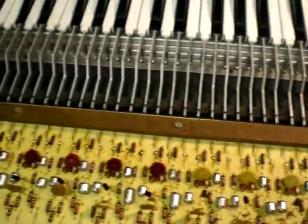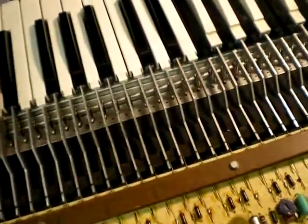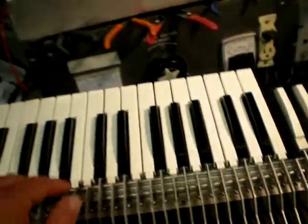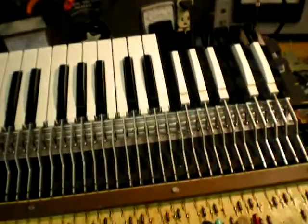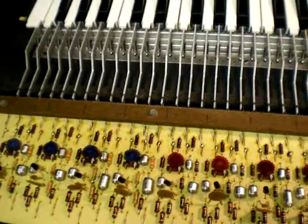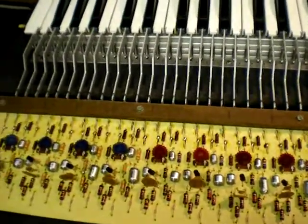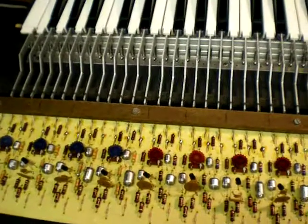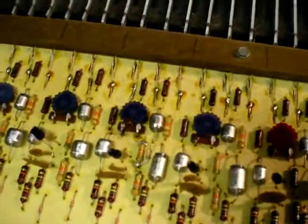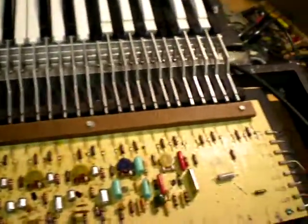They've got some wire around on that — I don't know what they did there. Anyway, monophonic, on groups of three notes all the way up. One of these pots was just disconnected, that's why it wasn't getting a three-note group in there. They didn't get a good solder through the hole — it's broken. I had to add a parallel resistance to trim it up on that one, because it didn't quite reach tune on that segment. The rest of them seemed okay, so I think we'll leave it at that.